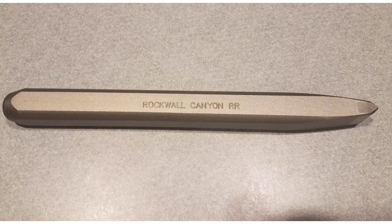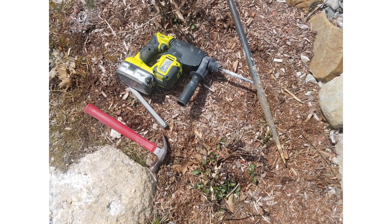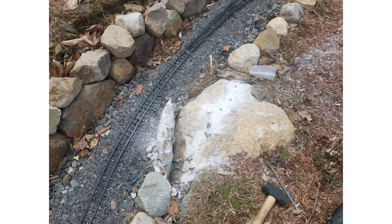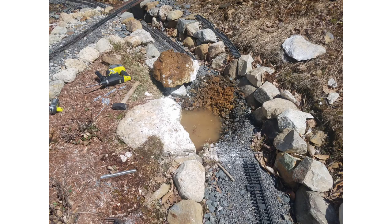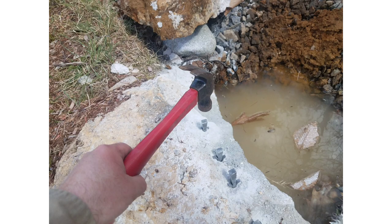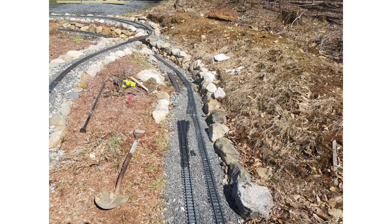So we got a new carbide tool. We drilled some holes in the rock and put wedge and feathers in there to bust it up. I used my Ryobi battery-powered hammer drill with a Bosch bit — it plowed right through the granite. I had to try maybe three times to get a good break, then got a giant chunk that came off. It was massive, very hard to lift, and required a big pry bar. The process is simple: just drill the holes, insert the wedge and feather, and tap with a hammer. It's all about patience and placement of the holes.